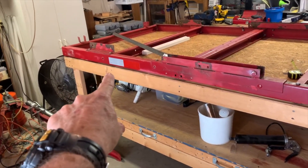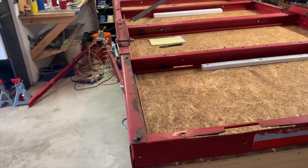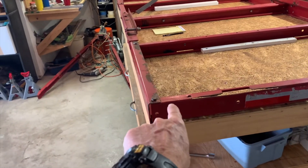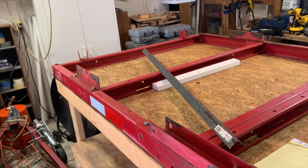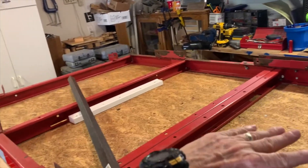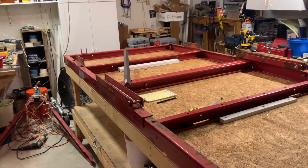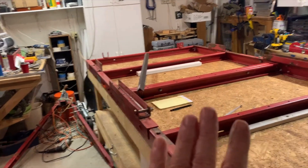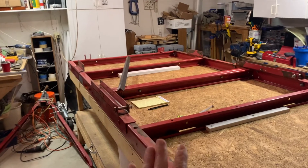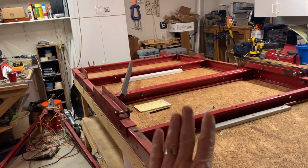I'm back now on my four by eight foot rolling table and it fits just perfect. Next is to start doing some welding on these joints and I've also got one-eighth inch angle iron that I'm going to put on the bottom and weld it to the beams for support — to get the sag out, keep it square, and for overall support of the trailer. I was going to show the welding in this part, but I think I'll stop part three here because it's getting long and I'll do that in part four. Thanks for watching — please like and comment and I'll see you in the next part.